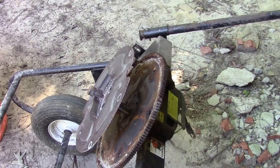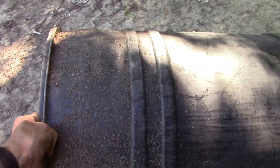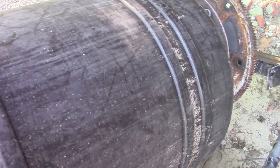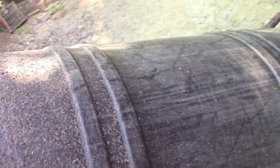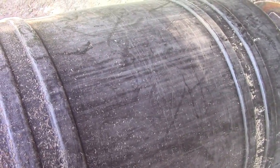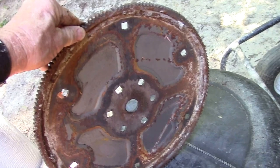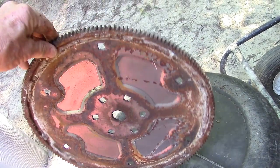Here's the barrel that I'm going to use to attach to the unit and fasten it back on to that plate. The next step is to line up the holes and bolt that on properly. I'm going to use the gear drive plate as my template in order to drill the holes into the back of my barrel.